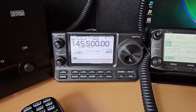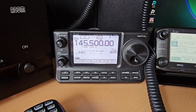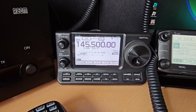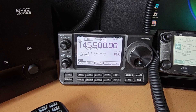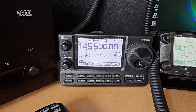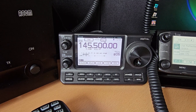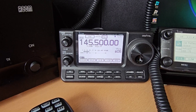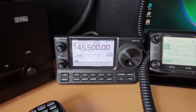It's a great little radio for anyone getting into amateur radio, especially newbies - it's ideal. The only things it is missing are two things really: an automatic ATU, so you have to get an external ATU for HF, and it misses a second receiver. But other than that, it basically does everything - it goes from HF to UHF, covers six meters and four meters, and it's all-mode as well. It's dead simple to use, gives you a lot of options in one box. It does D-Star digital as well.